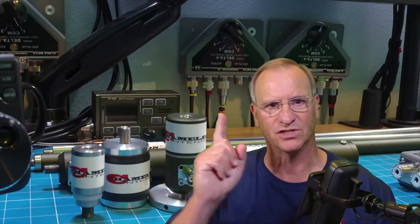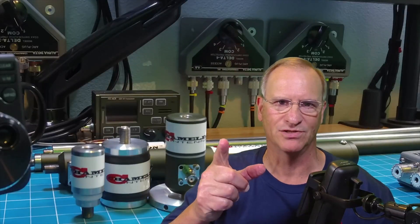As you watch my videos and you see me using these two switches to go between antennas or equipment, I can understand why that would be confusing — you can't see where my coax is running behind the workstation so you're not really sure how this is set up. I've gotten many questions on this subject and I thought it was time to finally talk about it. You don't need antenna switches to operate your shack — you can go single antenna to single transceiver and be just fine. If you have multiple antennas, go with a simplistic setup: one switch to drive your multiple antennas to one piece of gear. If you need something more complicated like I'm doing, I hope this helps. Another installment in the books on the HamShack Buildout series — hope you found this useful. Talk to you soon, 73.